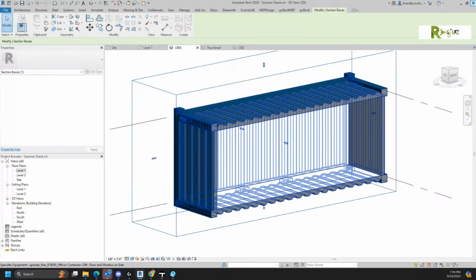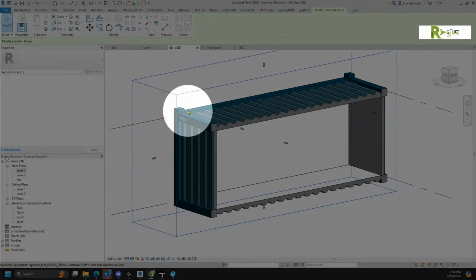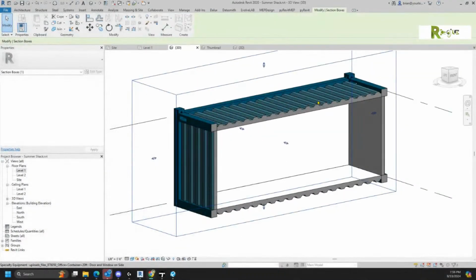Does that make sense? Well, the top of a shipping container has camber, because it is not structural. What they do is they stack these things on these points right here, and the roof can take no load whatsoever. Everyone who finds out I want to build with a shipping container says, you should bury that thing in the ground. Your walls will take most of the load, but when you start putting any soil up on that roof, that thing's going to collapse. You would have to pour a concrete roof on it first, maybe putting some reinforcement in it. Then you might be able to get away with it.